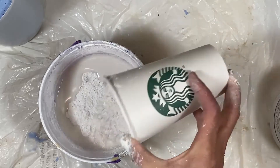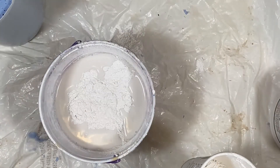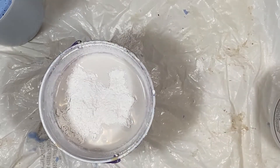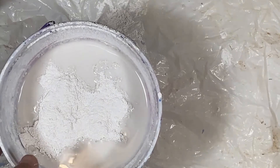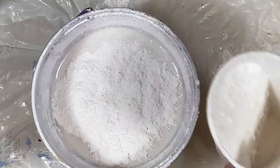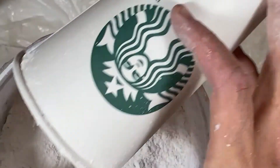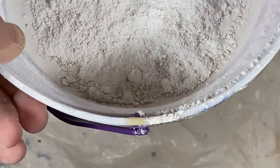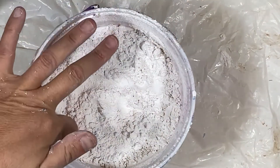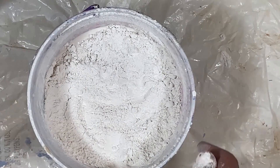The ratio is also about one-to-one. The way to test how much plaster you need is to add it little by little on top. Don't jiggle the container, don't mix in between — just let the plaster sink to the bottom. Continue adding until you get a dry crust all the way on top. Most videos show the mountain method, but I prefer the dry-wet crust method. If there's a heap in the middle, spread it around the edges.